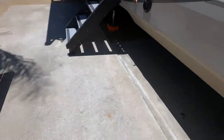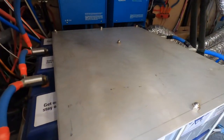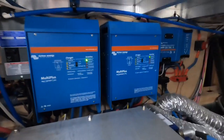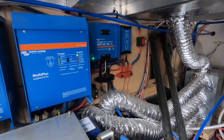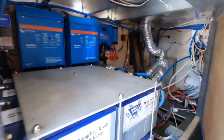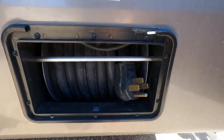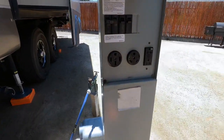I'll show you where we have all the batteries. This is our storage area. We've got 12 Battle Born batteries in a custom box I made, and we've got two Victron 3000-watt inverters, a solar charge controller, and a Victron Orion 24-to-12-volt converter so that we can run all the 12-volt portions of our RV. Being that we're in an RV park, I imagine a lot of you will think we're plugged in — we're not. Here is our plug, as you can see, and this is our pedestal. We're not plugged in.